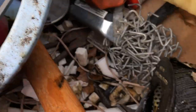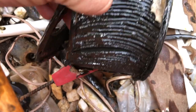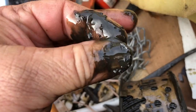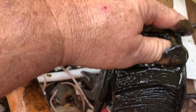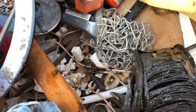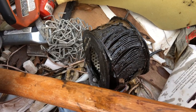I'm kind of peeling the filter apart a little bit, digging my fingernail in to see how nasty it is. Sludge. I don't feel anything metal in there — it's just sludge. I would say that's probably indicative of a tractor that doesn't get used that much. I've had this tractor maybe three or four years. I use it to mow — I bought it to mow with. A lot of sludge in that filter, but I don't think I've got anything seriously wrong. I'm gonna clean everything up, slap it together, and hopefully I've got good hydraulics.